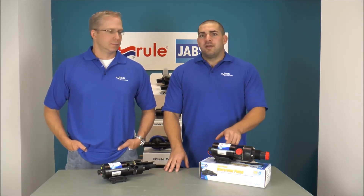If you don't want to get down and dirty, you can replace the entire unit. The 12-volt version has a part number of 18590-2092; if you have a 24-volt version it's 18590-2094. If your macerator label reads 18590-2592, it's actually the same as the retail 18590-2092, and the same applies for the 24-volt version.